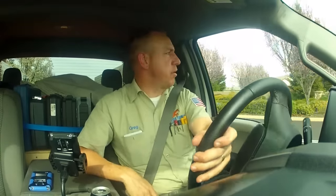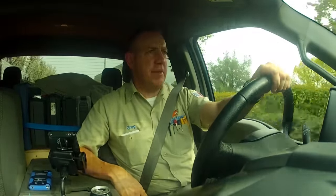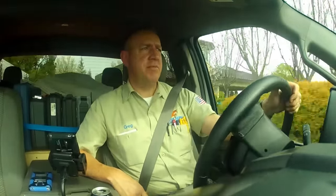Did some testing. The only thing that kind of caught me off guard a little bit was the purge time on the inducer motor is set for 30 seconds, and for some reason I forgot about that. So I'm sitting there thinking, why isn't the board engaging on the igniter quicker? It feels like it was off, but I counted it. It's about 30 seconds, and it says right there in the directions the purge time is 30 seconds before the igniter will start up. So, good times.